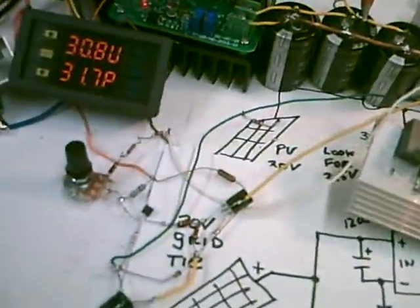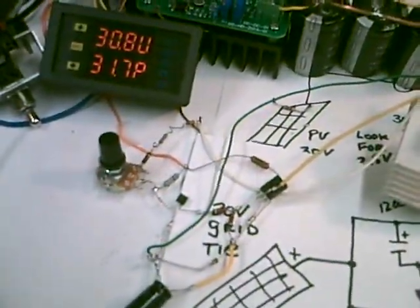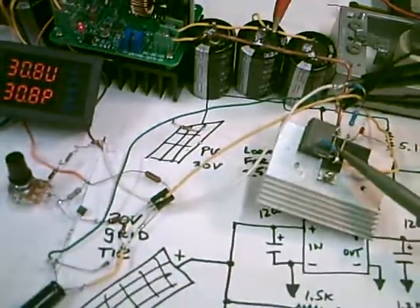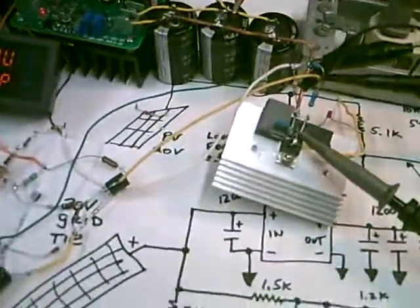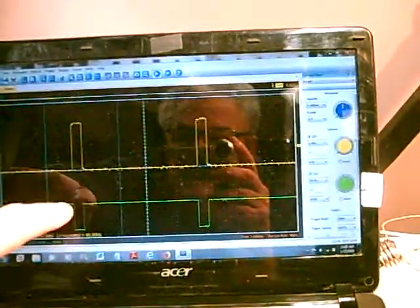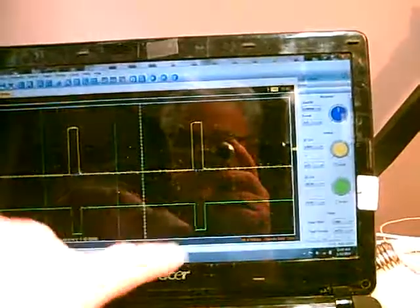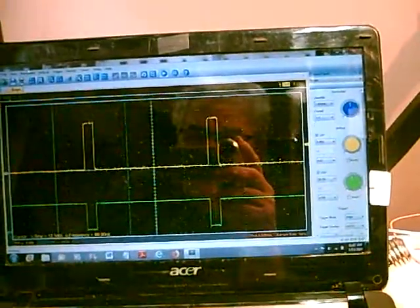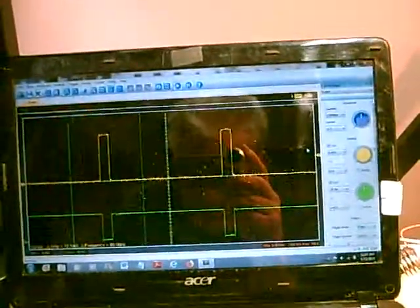And again, the boost control circuit is pretty much the same as before. We add an extra PNP transistor and again the FET. This is the output right now. Top trace is the gate drive, and the bottom trace is the output. It stays at 75 volts. When it goes low, that's when you're providing power onto the heating element. This is being measured right off the drain.